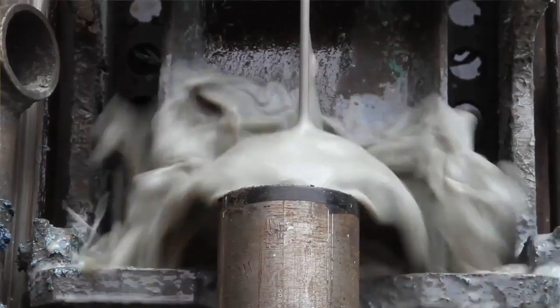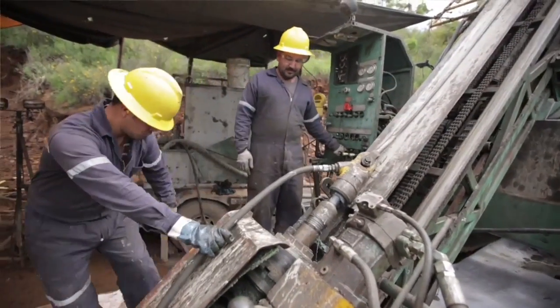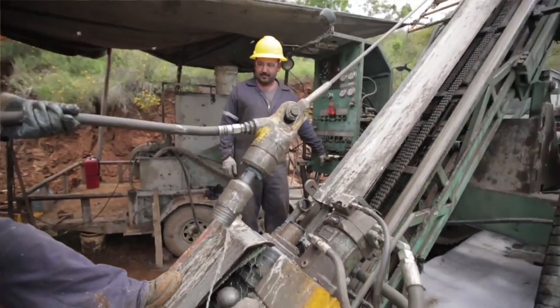It depends a lot on the rocks. If there's a lot of little faults and fractures in the rocks, as the drill goes through they'll tighten up on the rods. Sometimes you'll get open spaces where the rocks have been shifting, and when the diamond drill rods hit those, it causes a lot of problems. While you're drilling, you're pumping water down the pipes — going down, around the core, and back out to wash away the cuttings and cool the bit. When you hit some of these fissures, the water goes into the cracks and it's gone. All of a sudden you have a dry hole, and your bit will just burn right up because it's not being lubricated. You've got to pull all the rods up, replace the bit, and put them all back down — so you don't get production. The costs go way up if you slow down.